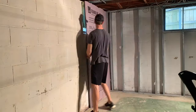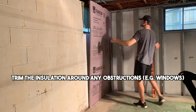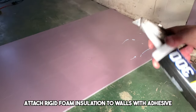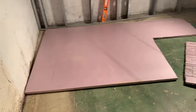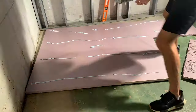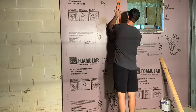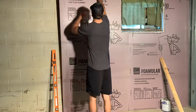With the insulation cut to the right height, I'm going to stand it up in place and use a level and a utility knife to score around that window so that I can snap off the piece of insulation there. Now I'm going to use this special foam board adhesive, which I'm going to apply to the back of the rigid foam insulation boards vertically, so that any water that ever gets on the back will be able to make its way down as opposed to horizontally. Then I'm going to trim off the remaining portion around the window, just like we did before.